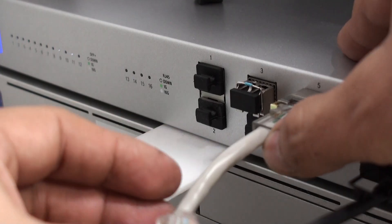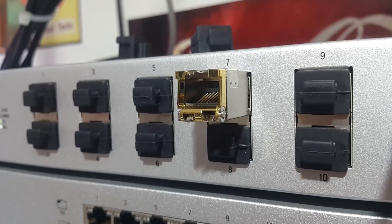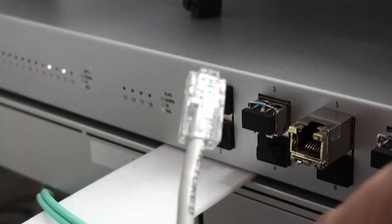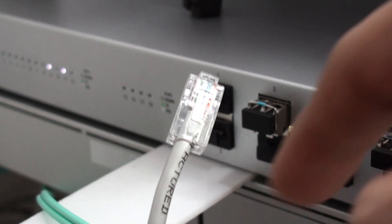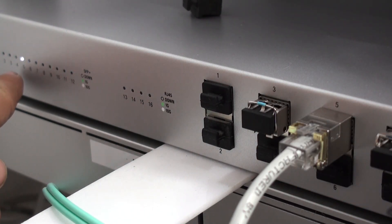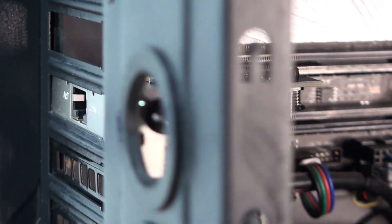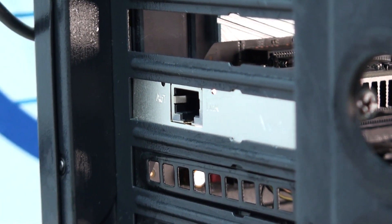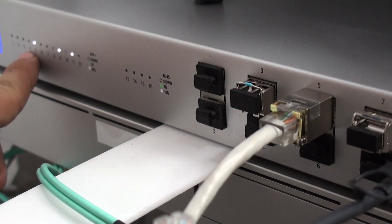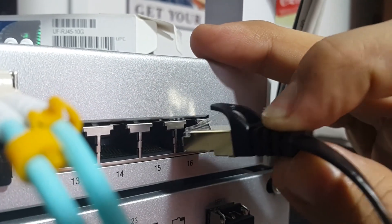Regarding wiring, our recommendation is to use Category 6 cable for 5Gbps links. Cabling is usually what people underestimate the most as a critical network component. Will you be able to get 5Gbps with a CAT5e cable? Yes, you will — just as you can extend beyond 120 or 130 meters for Gigabit Ethernet; we've done it and it worked, only outside standard parameters. However, cable length must stay well below the Ethernet standard, and it also depends on cable quality for 5Gbps. Much better would be Category 7 cabling, but realistically not all companies, small offices, and buildings have that available.